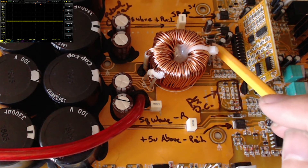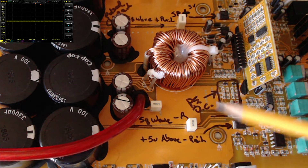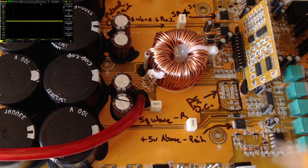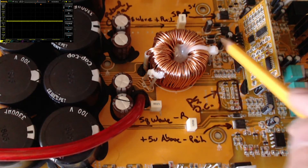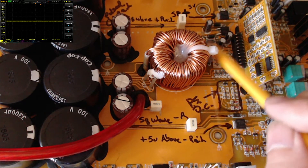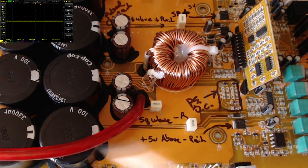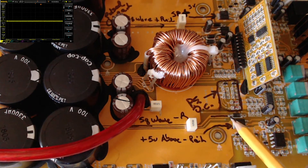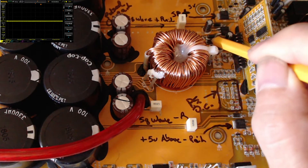These two diodes are referenced to the battery negative terminal, and they go back to windings on one of the two transformers. This winding goes back to T1, your left-side transformer, which goes to the negative battery terminal. As that transformer is swinging positive and negative, you're going to see a positive and negative square wave on the back side of these diodes. Similarly, with this diode referenced to the negative rail, you'll see a square wave on the back side of that diode.